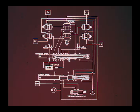The C2 shuttle valve permits pressurization of the C2 pilot valve from 2 different selector spool positions. The floating check ball is positioned against the seat opposite the incoming flow and causes the pressurized flow of oil to be directed to the C2 pilot valve. If the selector spool was moved to the opposite C2 supply position, the pressurized flow would enter the shuttle valve from the opposite side, positioning the ball against the seat port that had previously been open.